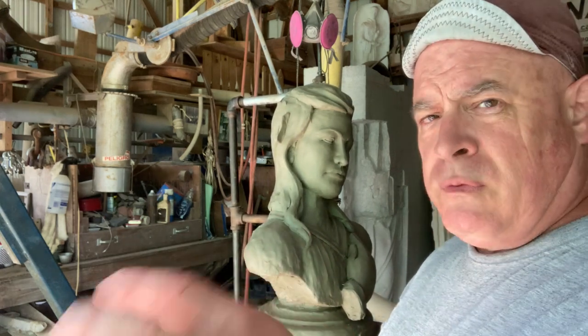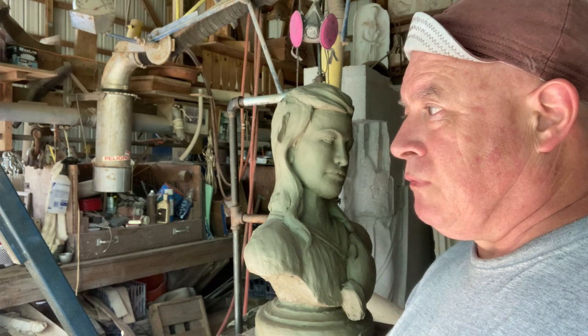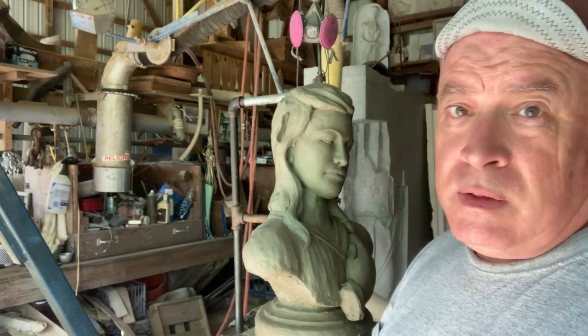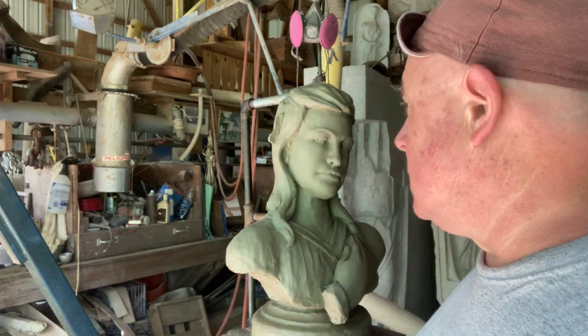Usually the mold, you'll reinforce it with a bunch of whatever. I mean, Angelo had a big bucket full of metal scraps, little angle iron, kind of like erector set stuff, and all kinds of little pieces that he thought would work. And then you would bury them in the plaster so that the actual mold doesn't break. But that's for a waste mold, one shot. We're going to do a silicone mold.